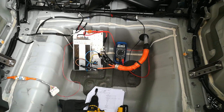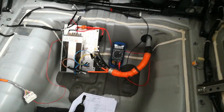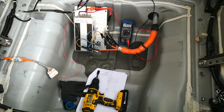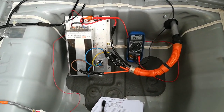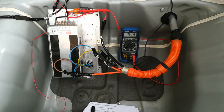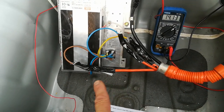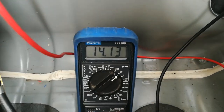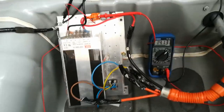This is the demo of the No-IMA 12-volt charging in operation. I've taken my battery out of the nickel metal hydride car and just got this simply wired in as a demonstration — it's not fixed out at all. Basically we have the three-phase wires here, the car is actually running, just ticking over, and you can see the charging voltage is 14.13 volts and the PSU is running.